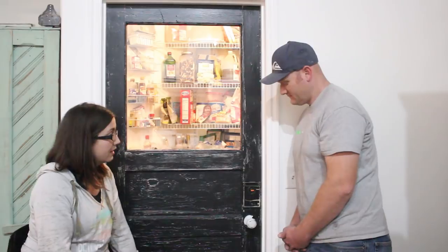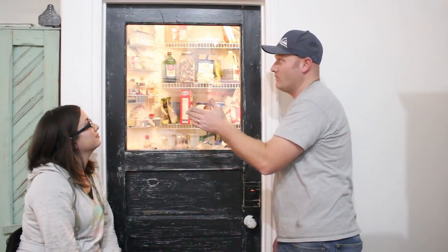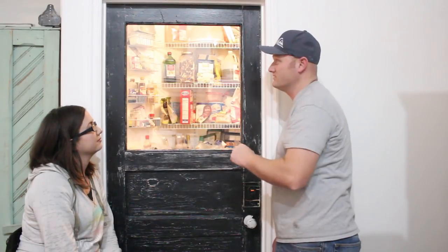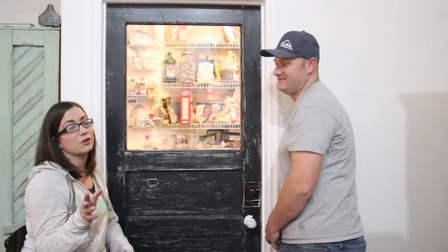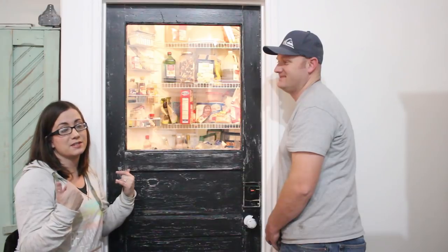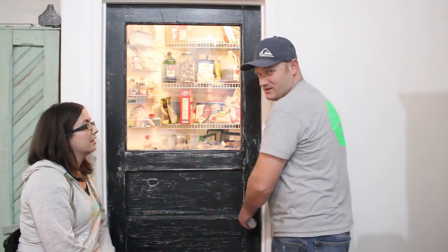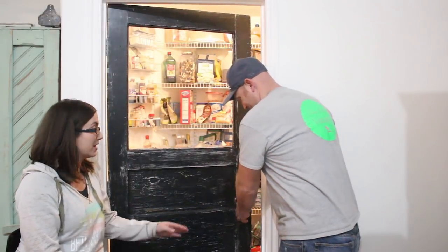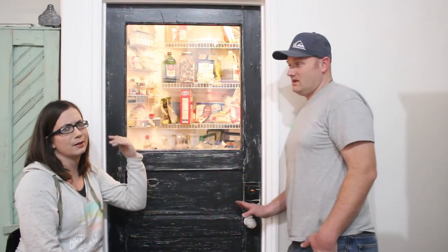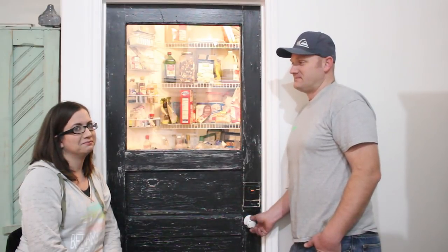That's how we made this brand new doorknob look old. Zeb can tell you about hanging it. I just trimmed off the side, put the hinges on — lined it up with the old door so I knew exactly how it was, and it fit first time without having to chisel more out. The doorknob we had to change out a couple times because you can't have that modern doorknob on an old door. Make sure you have the doorknob figured out before you hang the door. Jamie didn't want it for even half a minute — she said just take it off; it's better to have it off than on. Replica doorknobs with the porcelain are around $130, so this $15 Kwikset that looks totally old is a great solution.